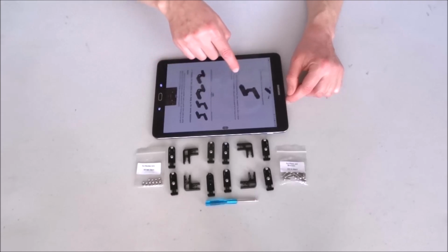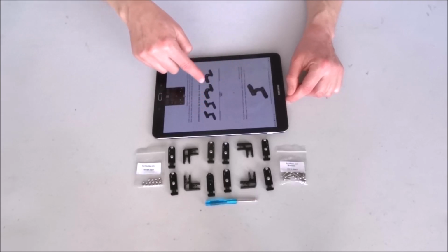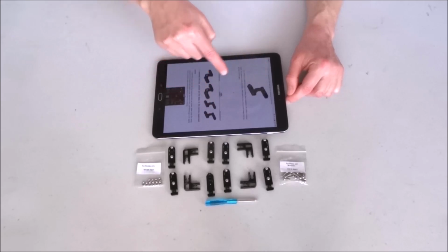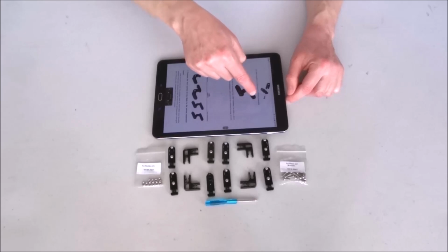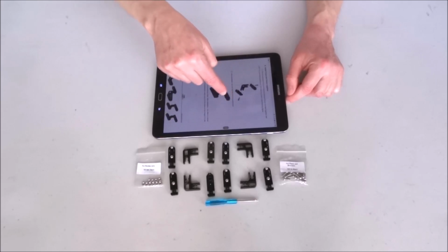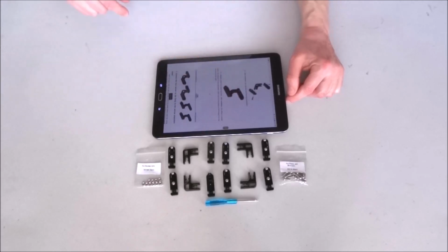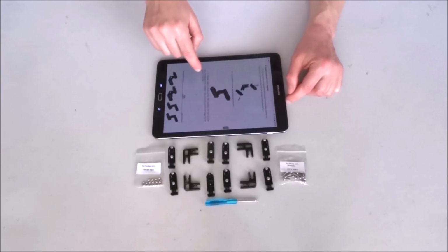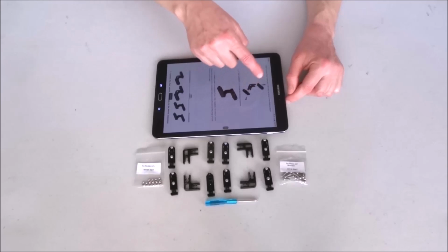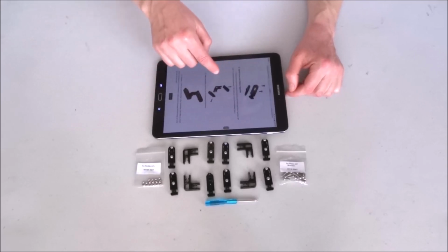However, looking at the following picture here, two of the legs will look exactly like this picture, these two, and the other two have to be opposite. So instead of this coxa being mounted like this, it will have to be mounted exactly the opposite way. So we'll have to be careful not to assemble all of them as shown on this picture, but two of them like this and two of them to be mirror image.